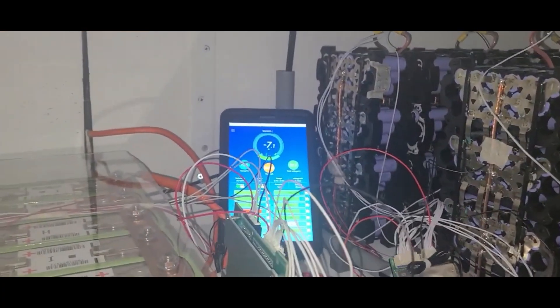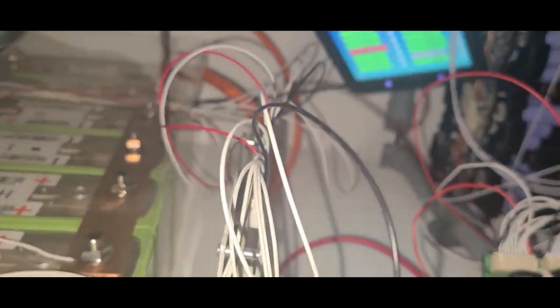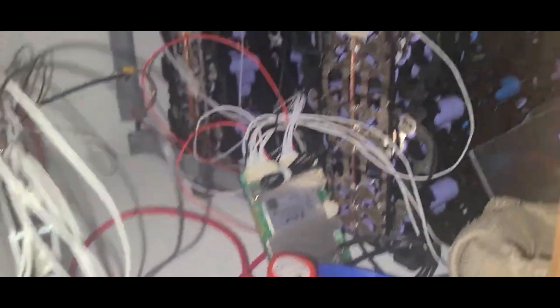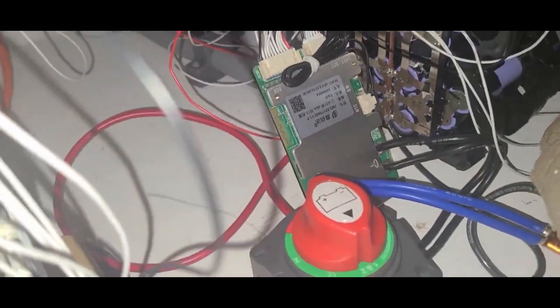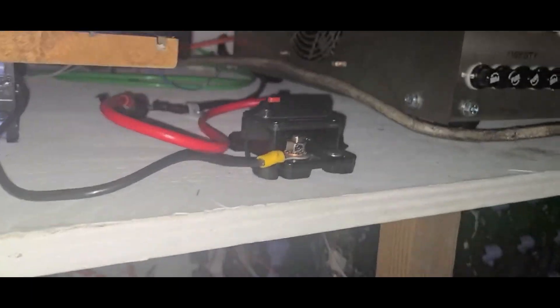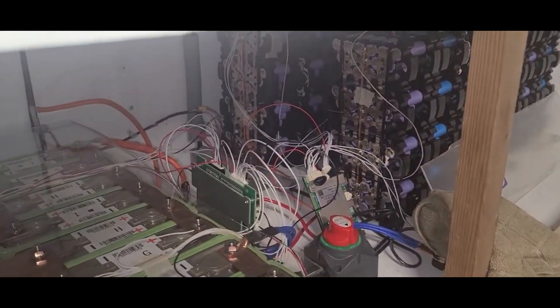The BMS is set up — I think I'm done here. My job is done, the BMS is fully set up. It's a lot — it's a nightmare to put together. Remember, if you're doing this with 17S, you've got to put four of them on the 13 wire and the thing will work 100 percent. That's the end of this video — don't forget to subscribe, it does help the channel tremendously.